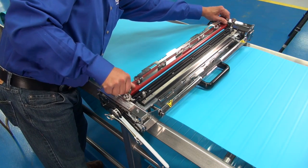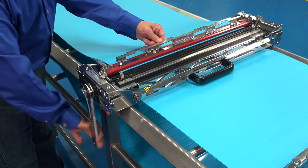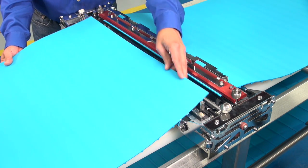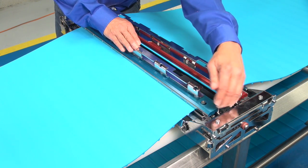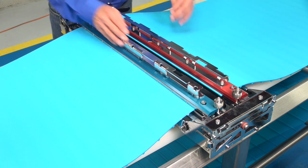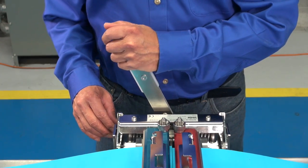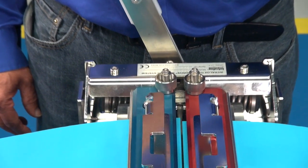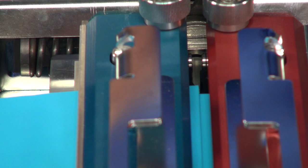Secure the belt end under the top clamp cut guide. After securing one end, use the handle to open the clamping fixture. Pull the other belt end in toward the clamping fixture center, being certain the belt drive bars are engaged in the corresponding grooves. Now lightly secure this belt end with the top clamp and thumb knobs. Notice that both cut guide edges are facing outward. Our belt is now nearly ready for splicing, but first we must precisely align the prepared ends with each other horizontally and vertically. Turning the handle back and forth gently brings the two belt ends together for a quick visual check — these edges are not aligned yet.